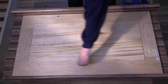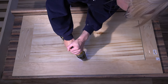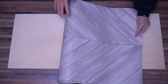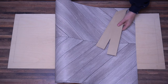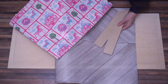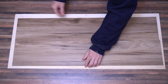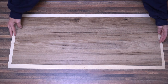We are going to remove the panel to add the design. Even if you're opting out of a design, I still recommend removing the panel for painting — getting into the corners will leave awful brush strokes, so for a more seamless look, paint the pieces separately. For a design, the options are endless: contact paper, wallpaper, stained strips of wood, even leftover wrapping paper. If it's flat and you like it, use it. I have leftover flooring I've been using on all my furniture projects, so I'll be using vinyl planks. Choose a glue that works with your material, glue it down, and make sure you can no longer see the reference line we made earlier. Then set the entire panel off to the side and start assembling the ladder.